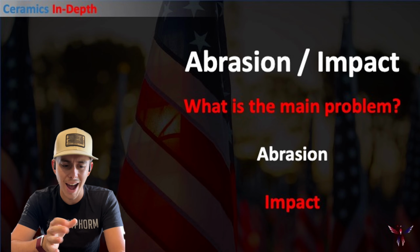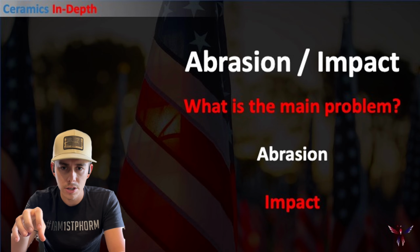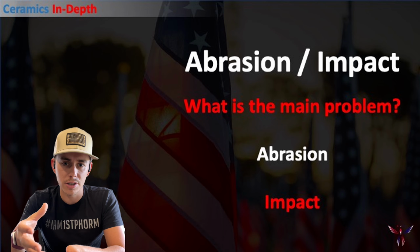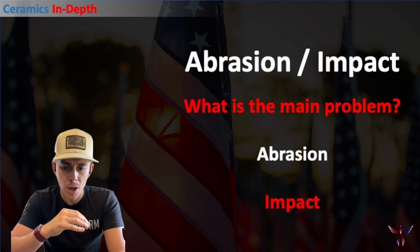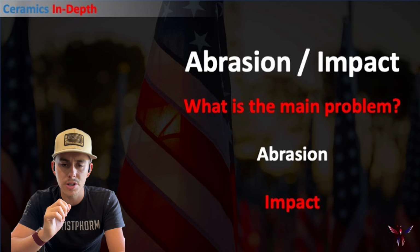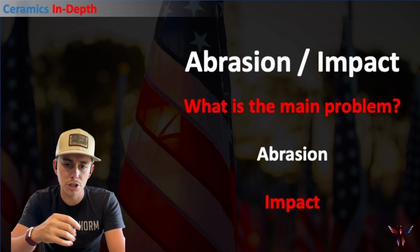If we switch to impact, generally I'm moving out of the ceramic powder into the beads or the carbide, and again, that just comes down to how aggressive is the application and what other limiting factors we have on the system. Whether it might be, well, hey, we still have a little bit of abrasion in there, stick with the beads, or hey, we want the best thing we can do, budget's not an issue, and we'll step up into the carbide.